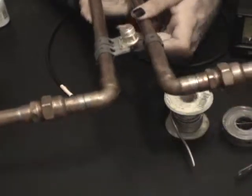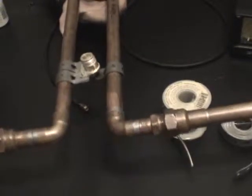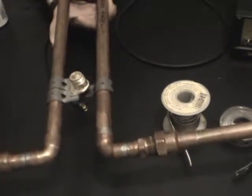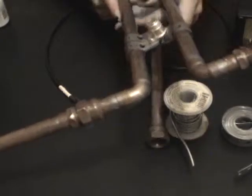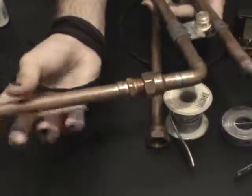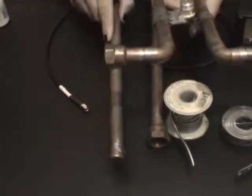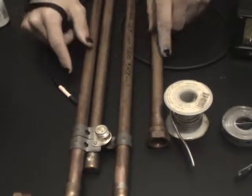Being that copper will tarnish and can rust, if you get this wet, it will eventually turn green, much like the Statue of Liberty. So if you do plan on keeping this outside, like Mustang and Uxer have, I would highly recommend that you coat the entire thing in some kind of spray paint. Non-conductive, of course, just some kind of flat color. If you have a homeowners association that would get upset if you have an antenna outside of your house, you can paint it to match the siding of your house and hide it fairly well.